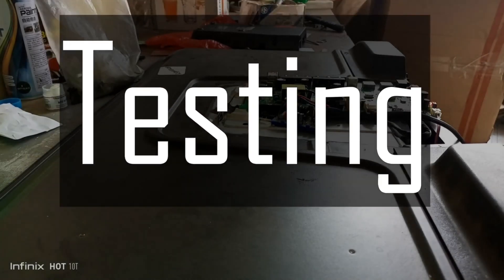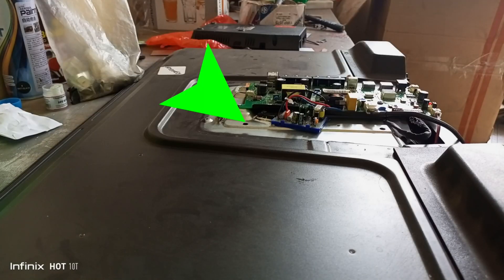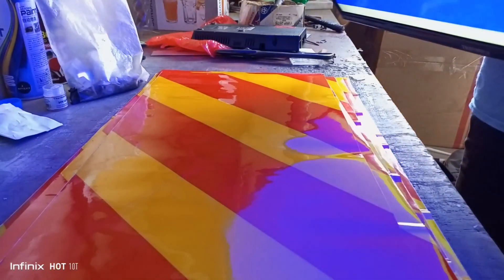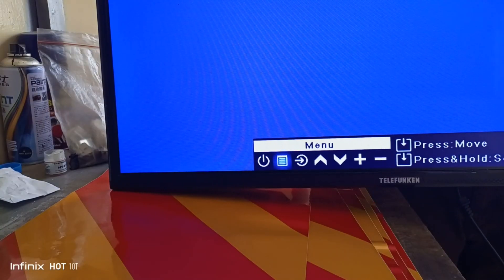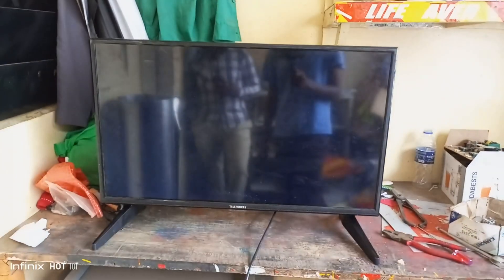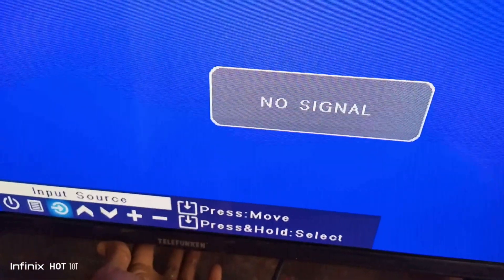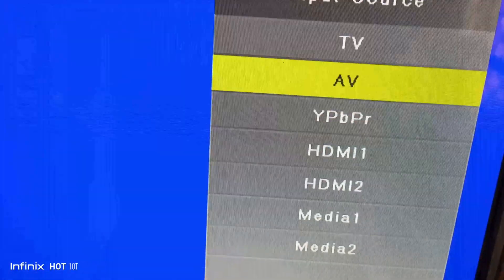And finally the testing. I have fixed the board to the TV and mounted the power module to the metal surface with a screw. Watch the green arrow — that's the backlight turning on. The LCD panel is okay too. I don't have the remote control for this model so I'll have to order it on AliExpress. This TV only has one button: press once to turn on, long press to enter the menu, but you can't navigate sub-menus without a remote. Thank you for watching and goodbye.